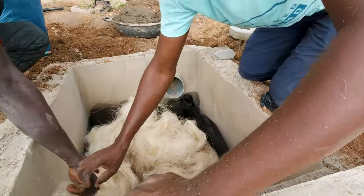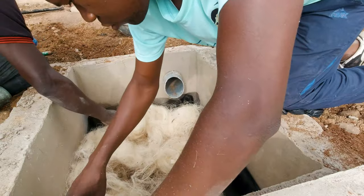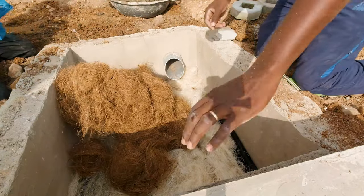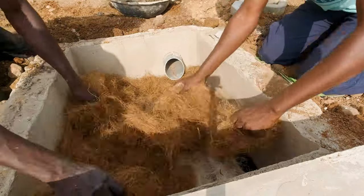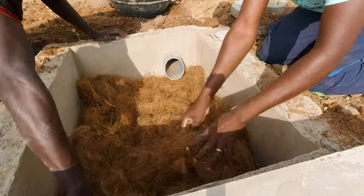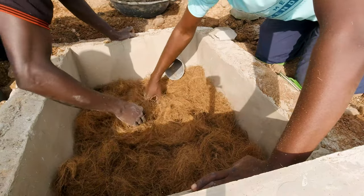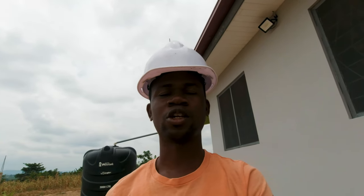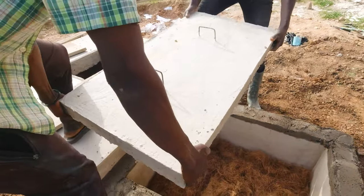After the fiber net, we placed in the pop fiber — leftover from the plasterboard corner molding works — also helping with sieving of materials. Then after that we placed in the fiber itself, which is treated coconut husk. It has been treated and contains microorganisms that feed on feces once feces are introduced. That was the final layer. We already had pipes in place: a four-inch pipe coming in from the house for sewage, and a two-to-three inch pipe between the biodigester and the soak away pit to allow liquid to flow across. After the final layer, we sealed the top of the biodigester.